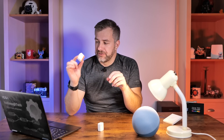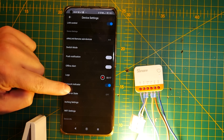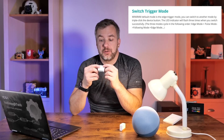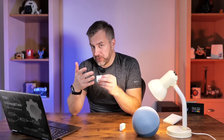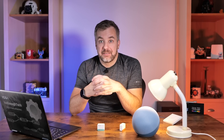I moved to options to see what else I've got, and it turns out — not many. I remember when I was playing with the orange version of the Sonoff Mini Extreme, I had access to all those extra options like selecting different switch types, detaching the relay altogether, setting inching, and default power-on behavior. None of that was present in my ecosystems. Fortunately, I know you can use the physical button to set different switch types — you can switch between pulse, edge, and follow — so you don't have to use the app to set it.